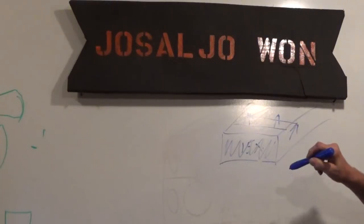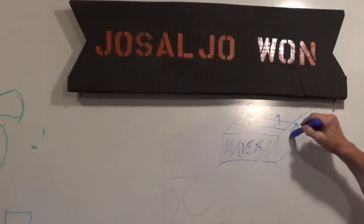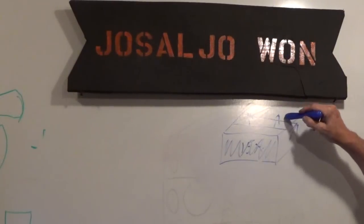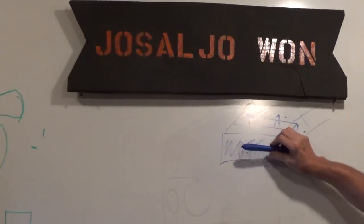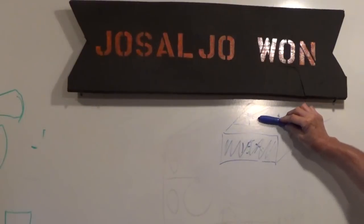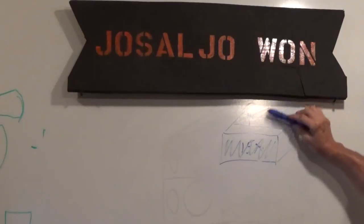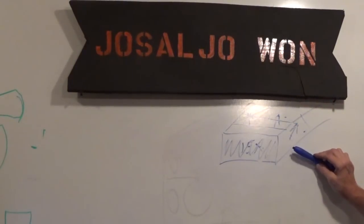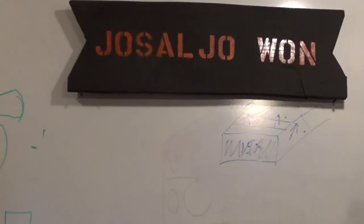So after blabbing about this stuff, why end coat? This is why, okay? Because the end dries 15 times faster than the rest of the wood, than the faces of the wood, right? And that helps to slow this down and let the rest speed up, so it'll all dry at the same speed, and therefore the same pace, therefore it'll stop it from cracking, or we're trying to stop it from cracking. So basically, guys, that's all there is to that.